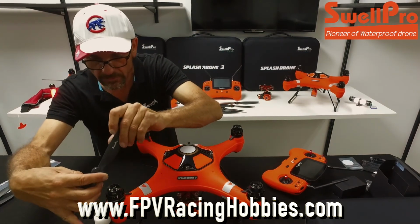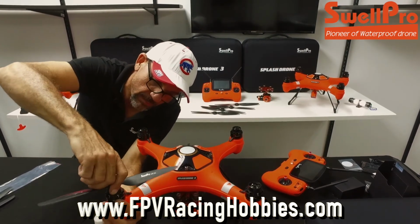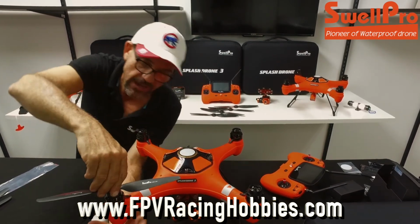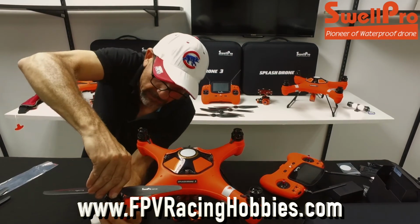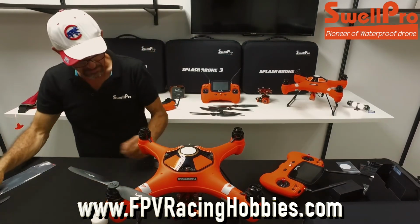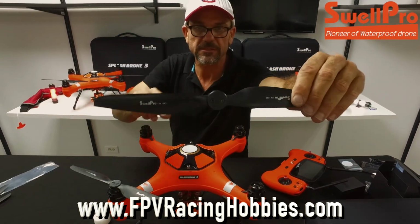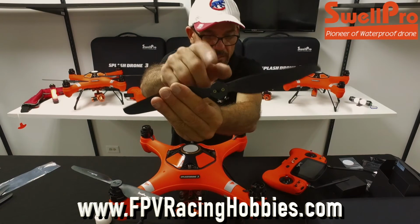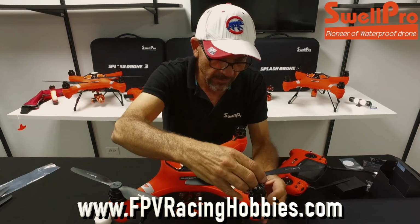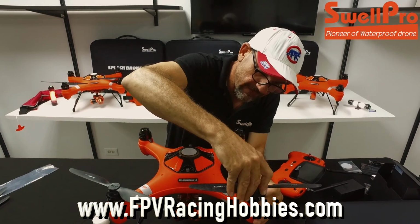The most important thing to get used to is which direction to twist and turn it, because it takes a fair amount of pressure, and you want to bring it down straight and even because the tolerances are a little tight. So I hold it like this because I'm way up high right now. Down and that turn, and then it's locked. And you can lift it up a little bit and you can feel that it's locked in. So let's look for the next one, and that would be CW, which would be clockwise, and there it is right there. So clockwise is going to go down, and we're going to turn it that way, which is the opposite direction of the motor rotation.